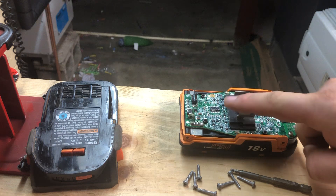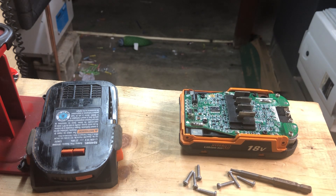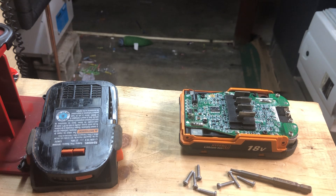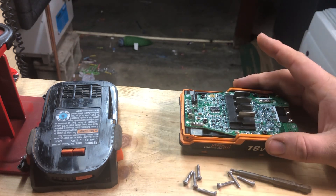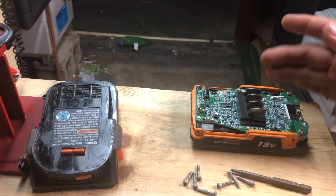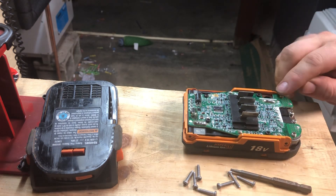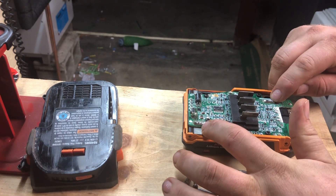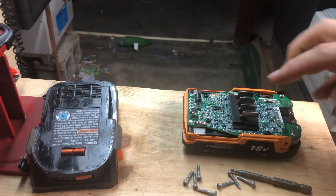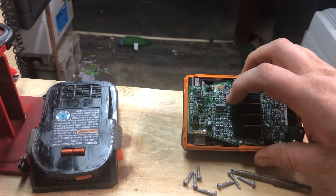The pins are very close together, so I cleaned it up really well and had to work it over multiple times. The first time I cleaned it and put it back on the charger, I still got a defective reading. One thing that's unfortunate is that when cleaning these pins you're doing it live — at least I was. Between the two large solder lugs is where the battery cell voltage sits: there was 13.5 volts between those two points.